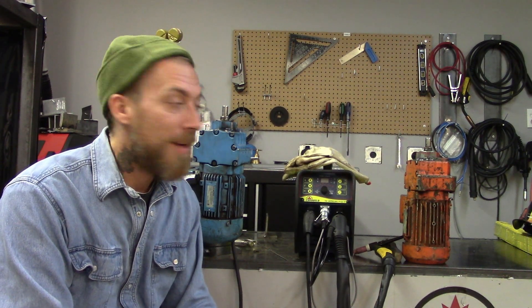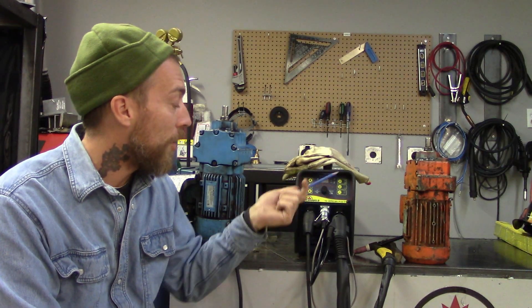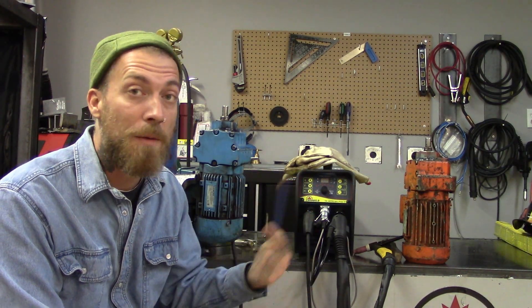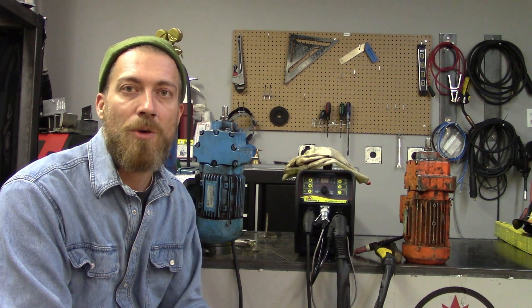What I should have done was get a bottle of acetone and take the time. Now these I couldn't soak in acetone because they're little motors, but if I could and had the time to take it completely apart, you'd want to soak it in acetone at least overnight and let it get really clean. You've got to get as many of those imperfections out of there as humanly possible.